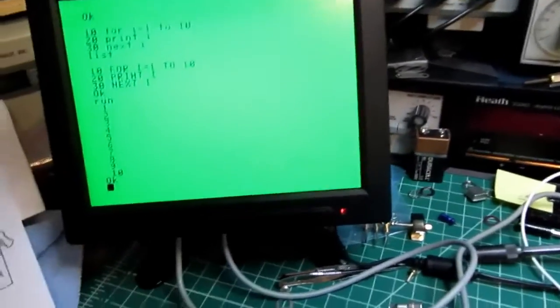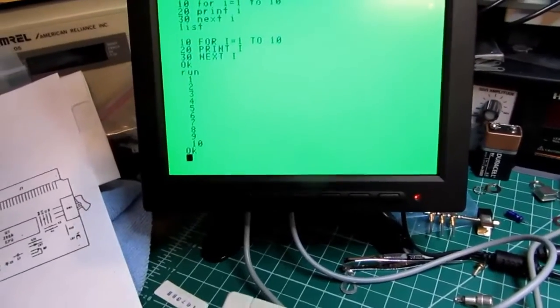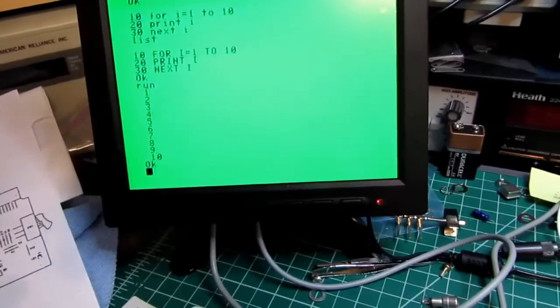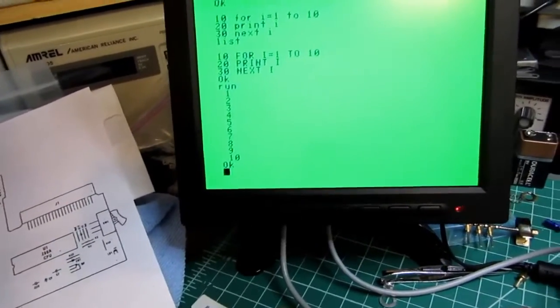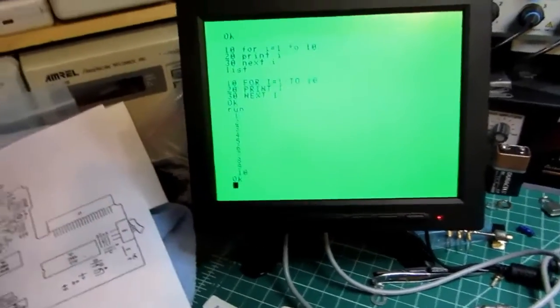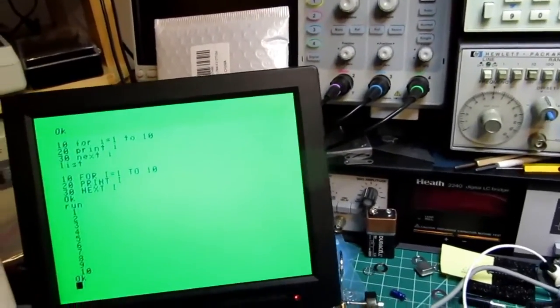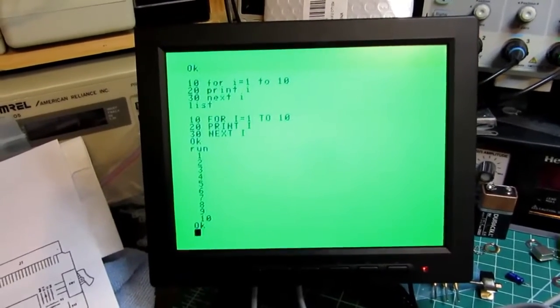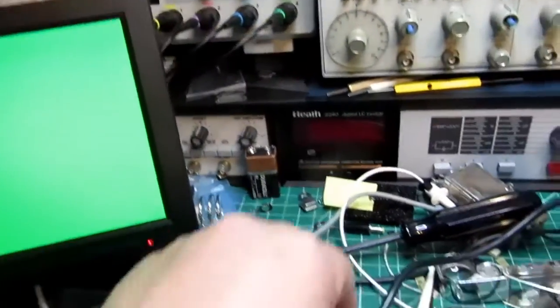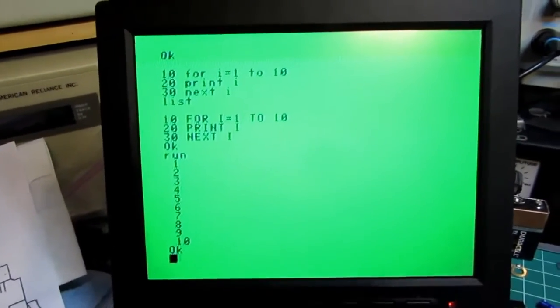I did run into a snag, not shown in this video. I had everything hooked up, I verified good connections, good continuity, good solder joints, but I had a lot more noise on the screen when I was using both the video and the audio cables on that same aluminum plate, and I got better results when I isolated the video from the audio ground. I'm not sure why, but what I ended up doing was just soldering an RCA cable onto the ground plane and the small amplifier circuit board for the video amplifier, and then just running the cable out the hole in the back. In that sense, it's no different than the power cable, which also can't be unplugged. It's not the way I wanted to do it, but it seemed to alleviate the issues I was having.